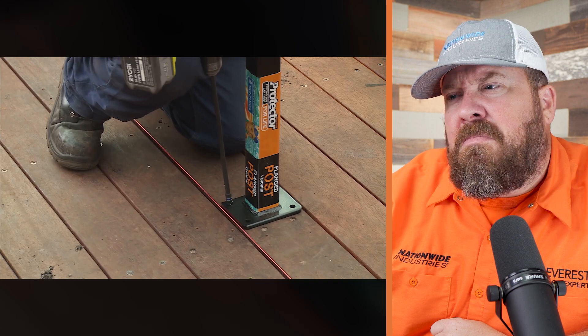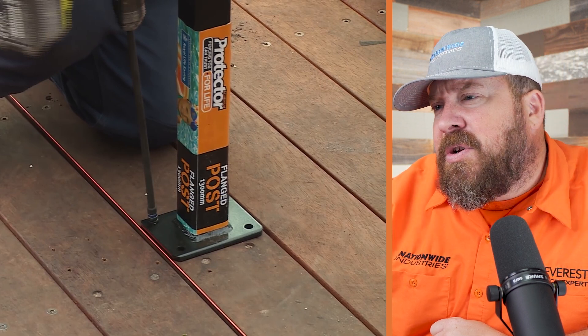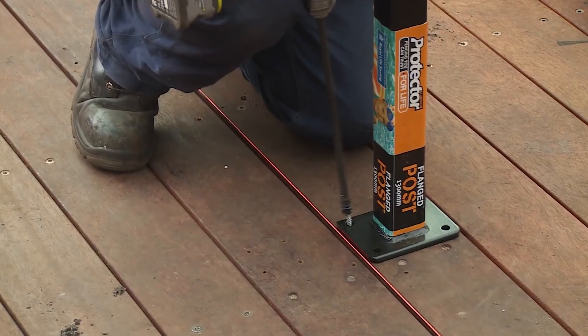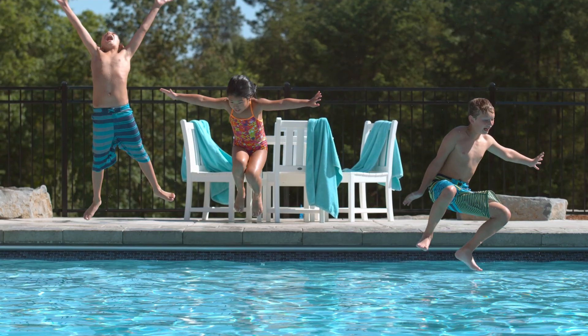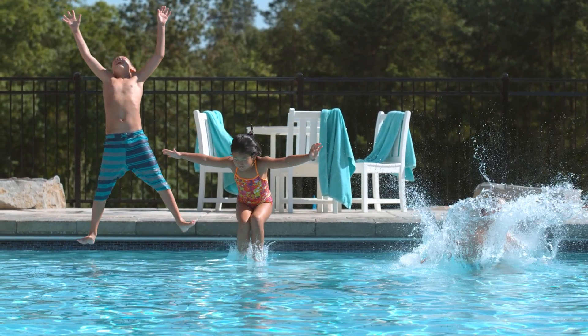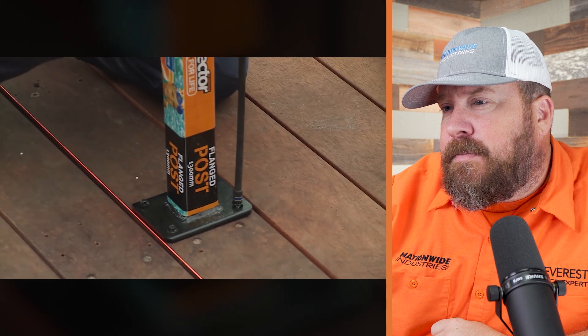They're setting their first post in. That's interesting — they sell a pre-welded post with a plate or flange already manufactured on it. Really nice for the DIY crowd that doesn't have access to a fab shop. I like that. Not in love with the size screws they're using here to attach it to the wood decking. They don't seem that large. I would be worried about the structural support these screws are rated for. The point of a safety fence around a pool or hot tub is to keep kids out. I think you would want to look into some larger, longer fasteners.